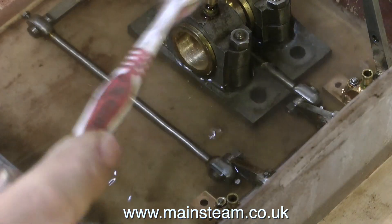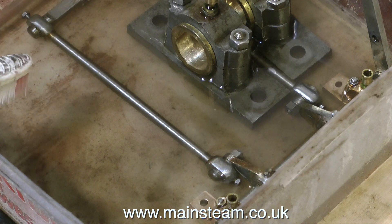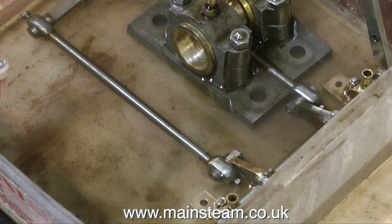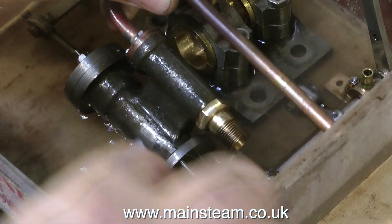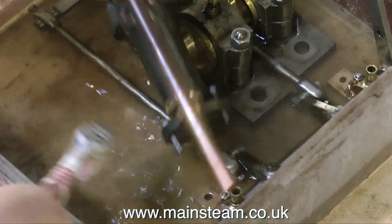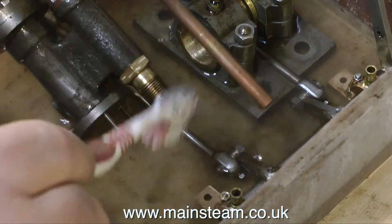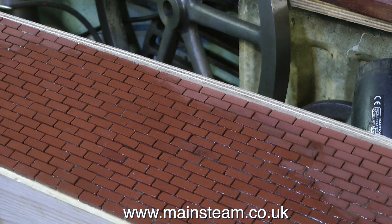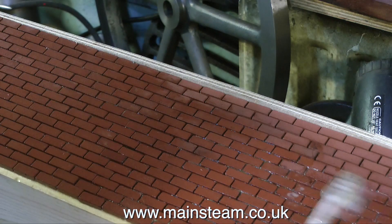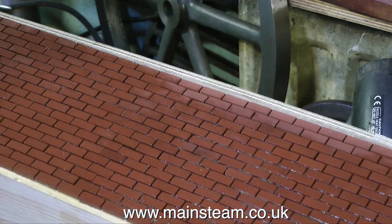Here's an interesting point. I'm just about to clean the water pump — that's not the interesting point. The interesting point is that this Gorilla Glue, in common with most of the other adhesives I looked at in the store, has a gap-filling property. So it expands as it goes off, which is possibly the last thing I need for this application. These bricks are on a mesh backing and the glue is expanding and filling the gaps between the bricks, which is no good at all — I need to fill those gaps with grouting, not Gorilla Glue. So I used some cellulose thinners and a small toothbrush to remove the expanding Gorilla Glue from between the bricks, and yes, it removed it very well.